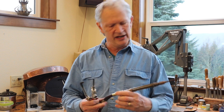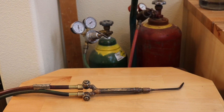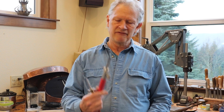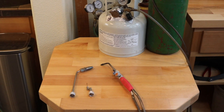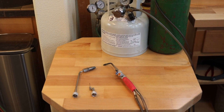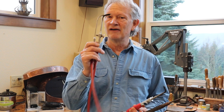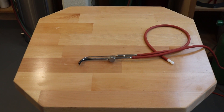I have my favorite three here. I have a basic welding torch that's oxygen and acetylene — I use this for melting, alloying, and casting. I have a propane-oxygen torch called the Swiss torch, which comes with a variety of tips — I use this for platinum work and sizings. And my favorite torch of all is the blowpipe, which I use with propane and breath. I'm going to go over each of these individually.